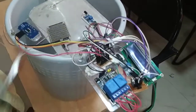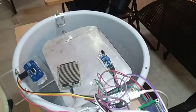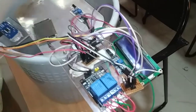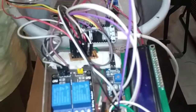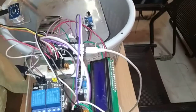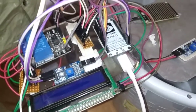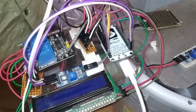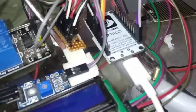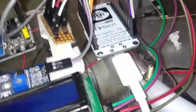We have used two power supply options — we can provide power alternately from a micro USB cable, or through a rechargeable battery. For the power junction, when we provide power supply from the micro USB cable, the supply comes to the NodeMCU microcontroller. From NodeMCU, the VIN pin and ground pin connect to the power junction. The VIN pin gives 5V DC supply, and all ground connections are taken from these pins in the power junction.